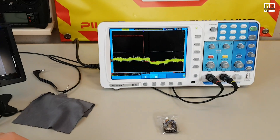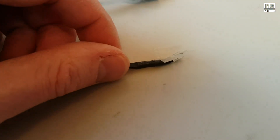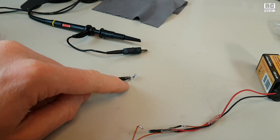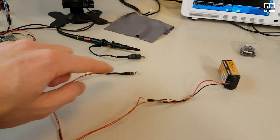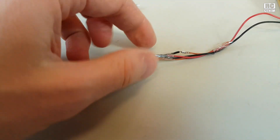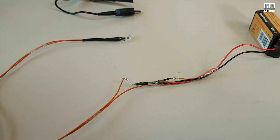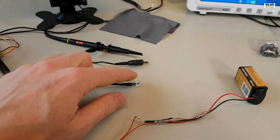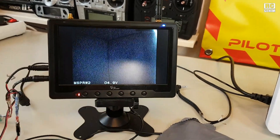A lot of you ask how I measure the yellow line which represents the video change. I have this little photo diode here — imagine it like a resistor. If light hits it, it changes its resistance and you can measure this change in the yellow curve. You have a plus and a minus on this cable. I probe it before and after a little resistor that I had to include, and you can then see the change and indirectly measure the change of light.